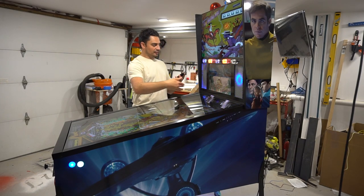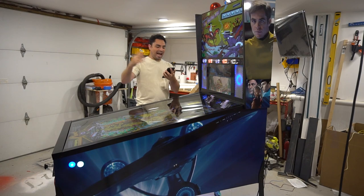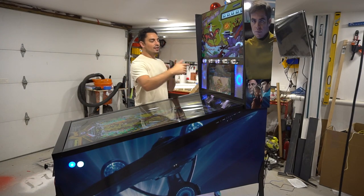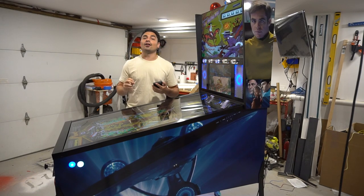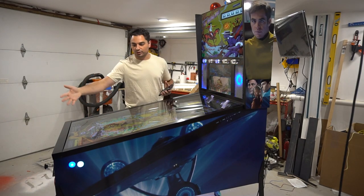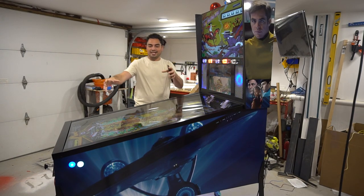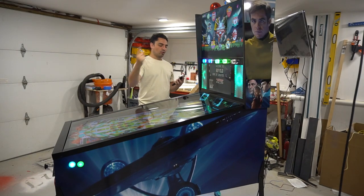We have the LED matrix, side rails, speaker panels, and two LED rings. There's also an analog plunger with nudge and tilt via the KL25Z board. For sound, we have the Z533 2.1 sound system — left and right speakers with a subwoofer cut out in the base. He also has surround sound feedback with four exciters front and back on the side walls for ball roll, plus two Dayton audio bass shakers for thump. Surround sound feedback alone has three amps: front, rear, and bass.